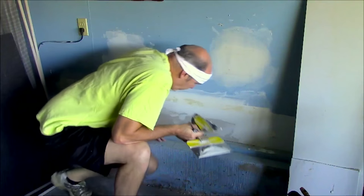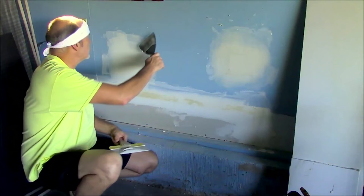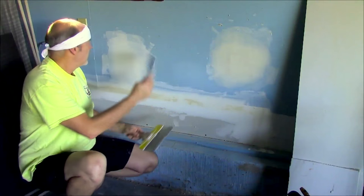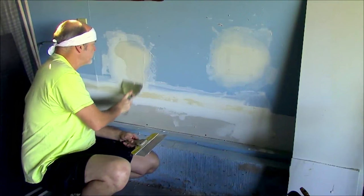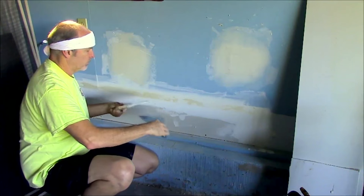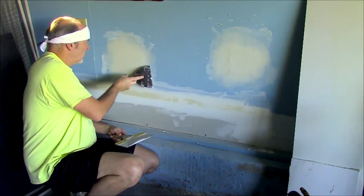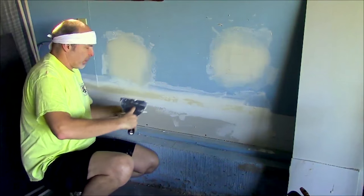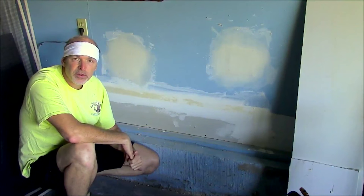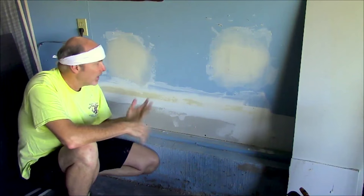To save a little time, I have my other patch here that's already been second coated. Same thing — I'm just going to scrape off the high spots a little bit, then another thin coat of mud. You're not going to get this perfect, believe me. That's why I tell you not to play with it too much. I'm going to let this patch dry, tomorrow I'll hit it with a third coat, let that dry, and then come back and hit them both with light sanding of either 100 or 120 grit paper, and then I'm ready for primer and paint.